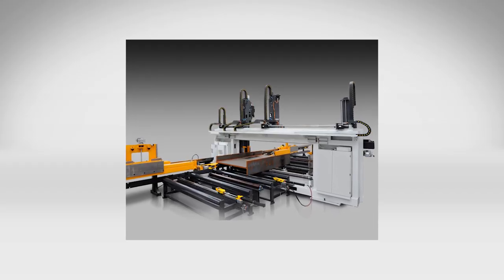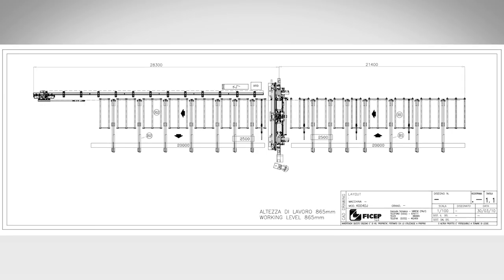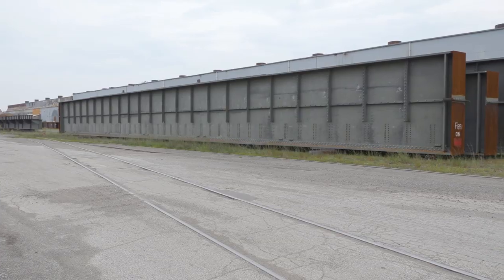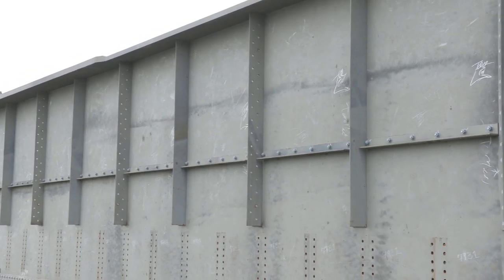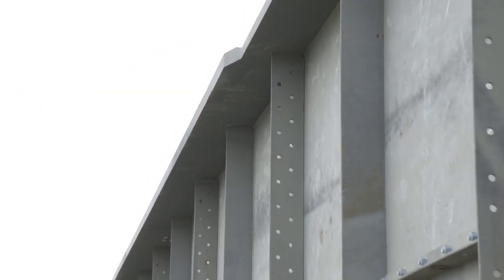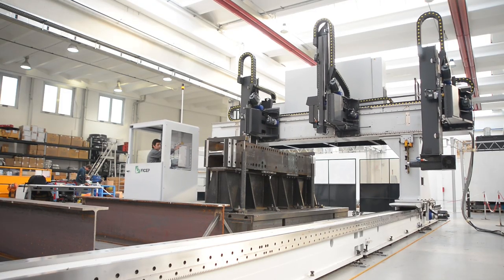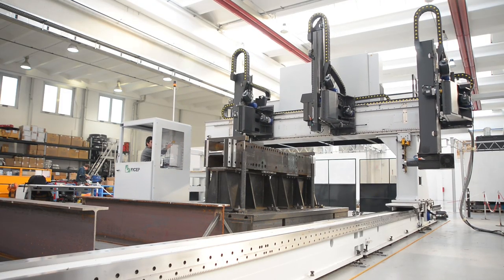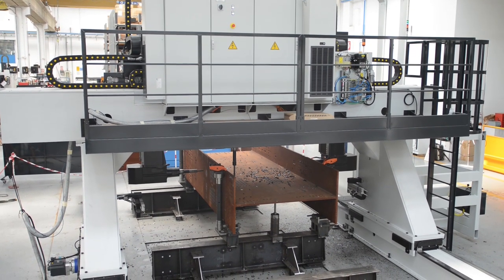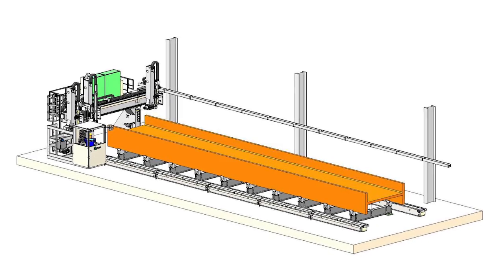The production of girder drills is not new to FICHEP, but the pull-through design required an extensive footprint to accommodate both the entry and exit conveyors. In addition, as welded girders frequently have differing flange heights along the length, they are not always conducive to conveying through a traditional drilling line. In contrast, the Endeavour gantry drilling system from FICHEP processes girders that remain stationary. The Endeavour gantry drill travels the length of the weldment to drastically reduce the system's required footprint.